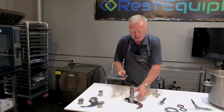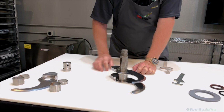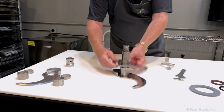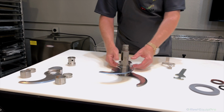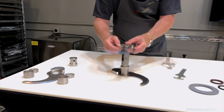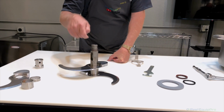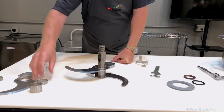So let's take a look at that. So that is directly over the other blade. Well, that wouldn't be good because you'd have too much weight on one side. If you went one over, you'd say, well, that works, but no, not quite. It just doesn't look right. It's actually 2 over, 3 blades, a hexagon shaft, 6 sides, a blade every 2 spaces.